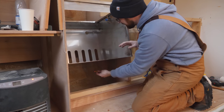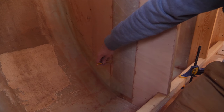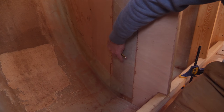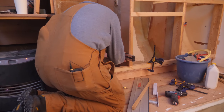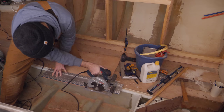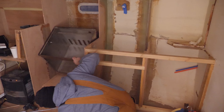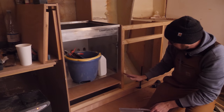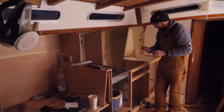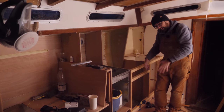I also need to figure out the area underneath and behind the gimbal box. I held the pencil against the corner of the stove and rocked the stove back and forth, so now I know the absolute lowest point when the stove gimbals. I did the same thing back here, allowing the gimbal to swing to 25 degrees. The storage underneath the gimbal box is going to be a little tight, but I think it'll still be good for cooling racks and stuff. This should give me just about two centimeters — just shy of an inch — of clearance underneath the gimbal box. The next logical step is to get the toe kick glued and screwed in place, and then seal up all the inside edges on the back so that any water drains into the bilge instead of pooling on the cabin sole.